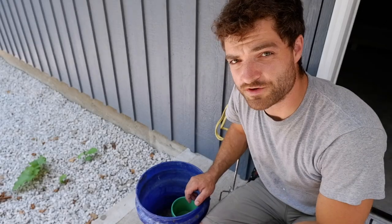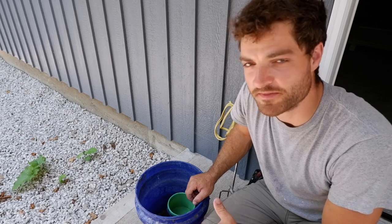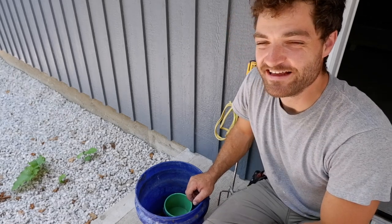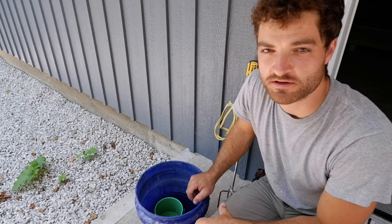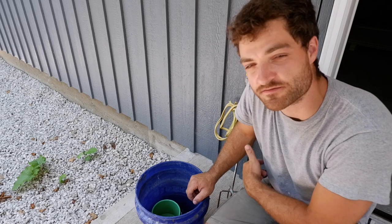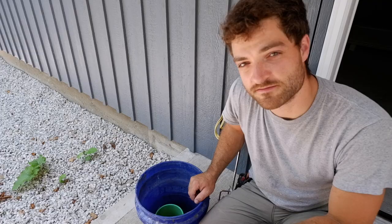I'll do that for all the inside corners, and the outside corners get the corner bead. I've got all the tape cut to size and placed within reach — just pieces hanging down everywhere, but I know what goes where. I have two options: mix one batch and try to get it all done, but I'm not that confident. It's easier to apply wet mud than remove dry mud, especially with 90 because it dries much harder even though it's sandable. I'll mix two batches — sometimes the slow route is the fast route.